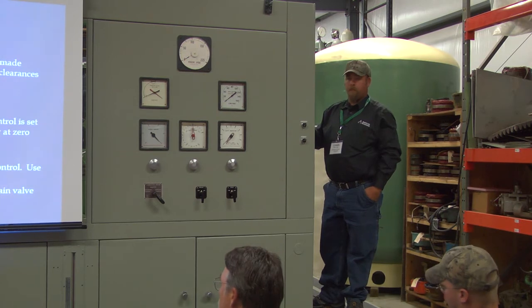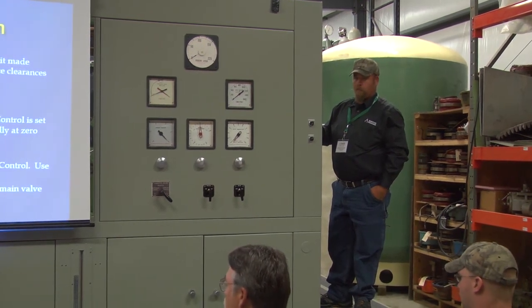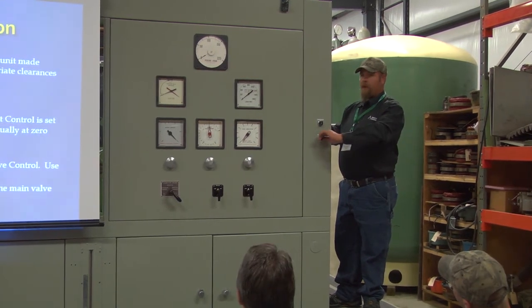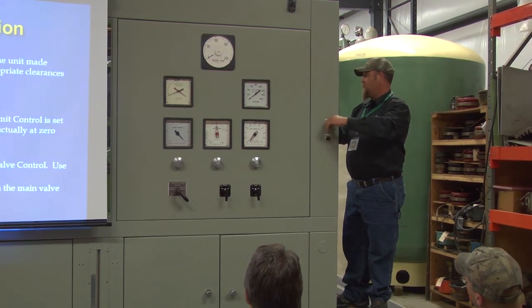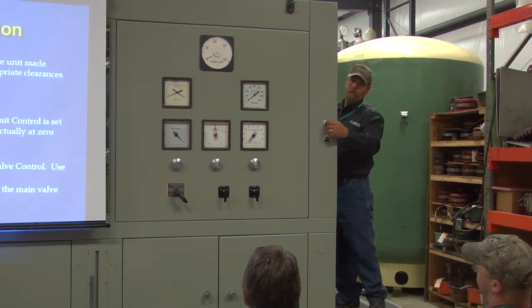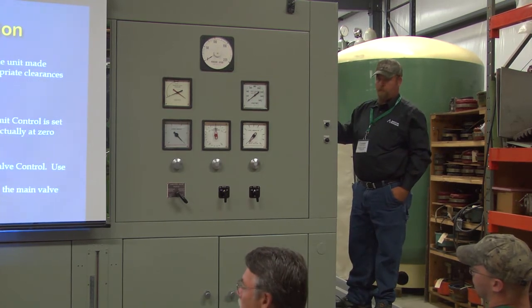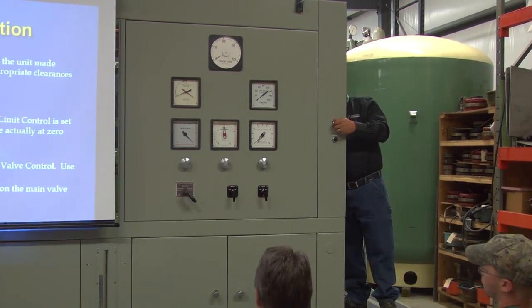So right now we've got water's off the unit, all right, head gates in. Both solenoids are picked up, correct? I've got them de-energized. You want them energized? Energized is where you're at, isn't it? That's energized, huh? Okay, we don't need the other one on. The governor gate limit is at 0, so we're safe that way.